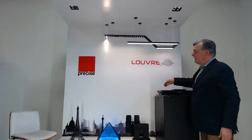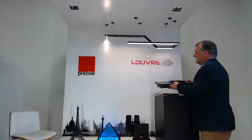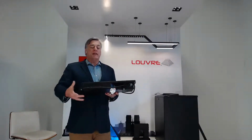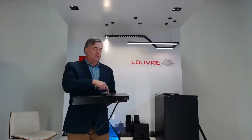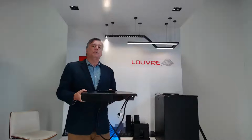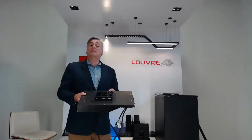Now, in addition to Zen Light, we also offer a complete downlight line, and we have new construction IC. We brought out last year the shallow downlight, which is very unique because, as you can see by this version, it's actually 2 3/8 inches in depth. We accomplish that by having heat pipe technology draw the heat away from the light engine and bring it out to two large D-shaped sets of cooling fins, hence the larger footprint. That gave us the ability to produce this fixture in up to 30 watts.